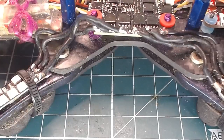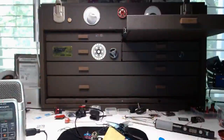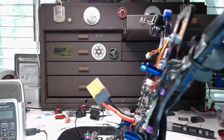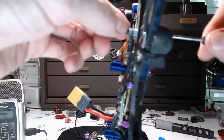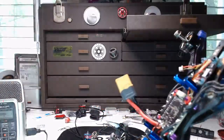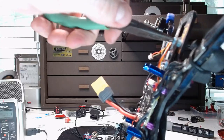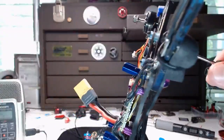And I'm going to use Nylock nuts because this... Yeah, so here's what I was saying about being able to still spin these lower guys. And of course, as I say that, this one is so tight that I can barely spin it. No, it's not. I can still spin it. See what I mean? So I can just hold the lock nut with my left hand or in a pair of pliers and get it nice and tight easily without needing to use the nut grabbers. Alright, and now I'm into the Nylock, and all is well. Next.